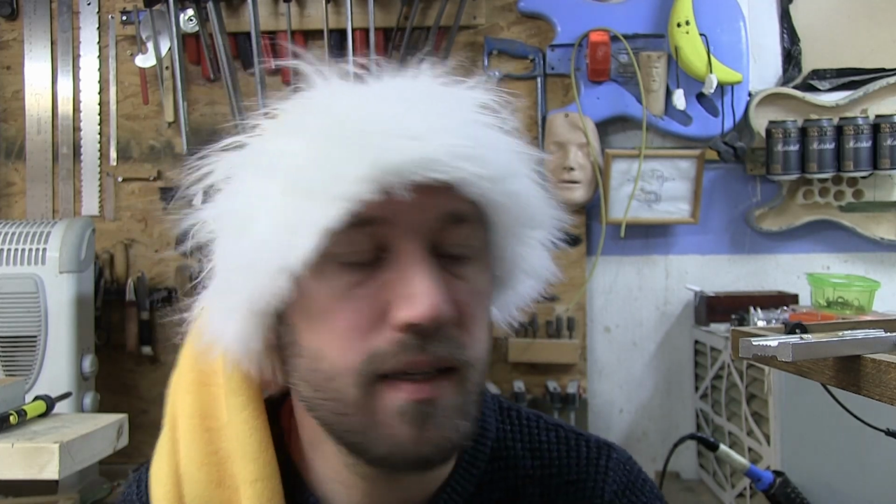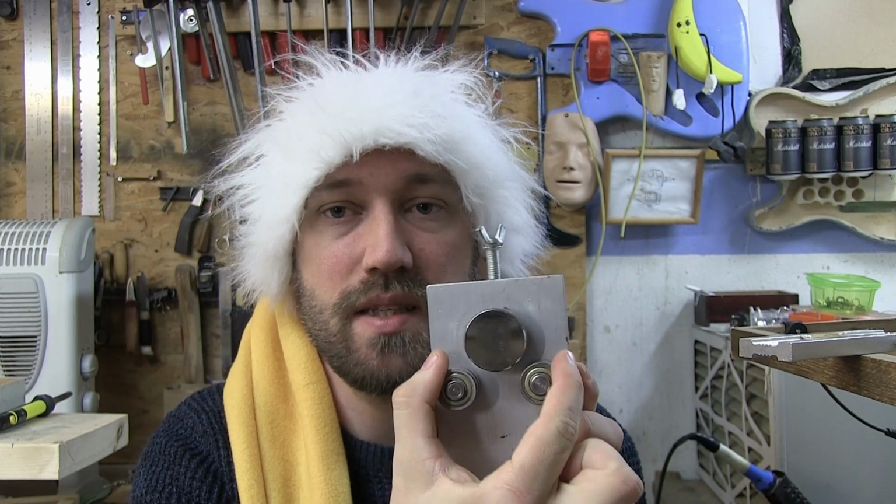When it comes to pre-cutting the wire before you install it, and before you radius it, it's much easier to radius a long piece of wire than a short piece. Your last fret on a neck is somewhere around 6 centimeters, give or take depending on the neck, and that's a very short piece of wire. It's about this long, and rolling that in between here, as you can see, there isn't much space. So I would say radius all your wire to the right radius, and then cut them to the right length afterwards when you hold it up to the fretboard and match it up. That's the easiest way to do it.